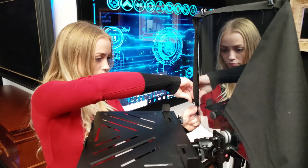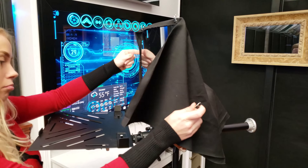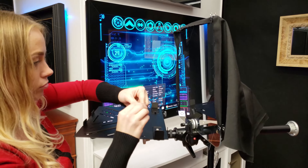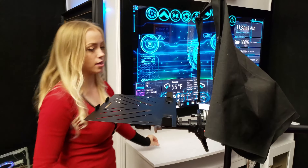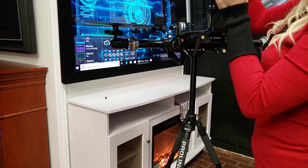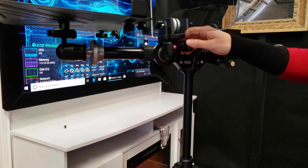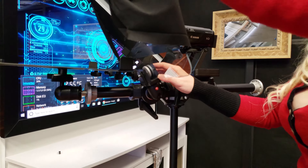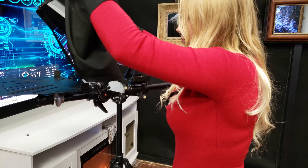It's a gear shift. As you can see, looking this way, our beam splitter mirror is not exactly straight or at the right angle, so we're going to adjust that. There's a knob behind here that you want to loosen, and this simply gives you a free range of motion for your beam splitter. We want it at a 45-degree angle — make sure that's super tight.